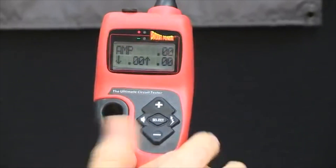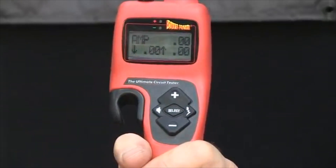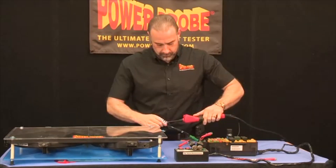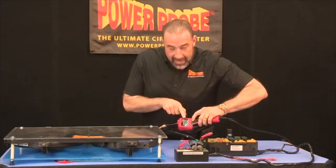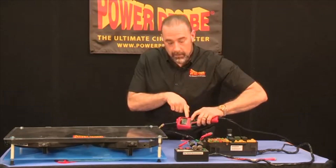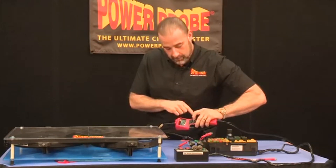Notice that while in this mode, the top reading is the average, the lower right corner is the maximum, and the lower left corner is the minimum. Watch as we supply power to the fan circuit here. As I stated, this is the average, the minimum, and the maximum current. With it off, the minimum and maximum has stayed there. If I want to reset that, I just press the hot shot button, and that resets my min and max.